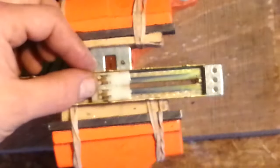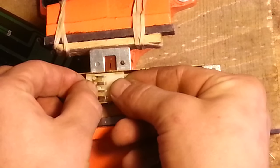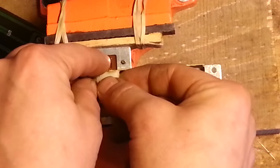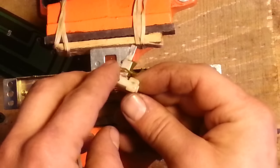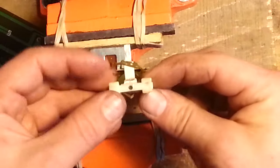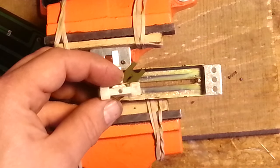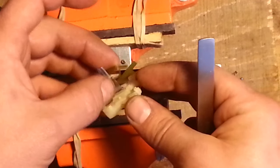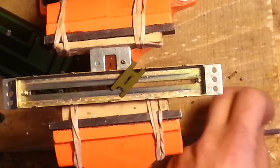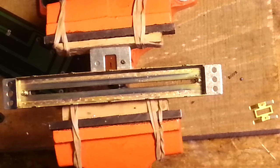I have a small pair of electronics tweezers here. I like to get everything nice and clean, and then we're going to clean the inside of this too. Since we are removing the ball, we're just going to pull this up slowly so it comes out in one piece. You see that — that's the little ball, so we can pull that out of there, and then the little spring that comes up behind it comes out of that hole. Then you just have an empty hole, and that's how we're going to leave it because this DJ does not want the click.